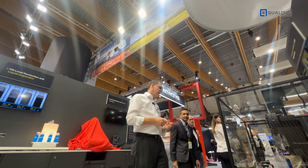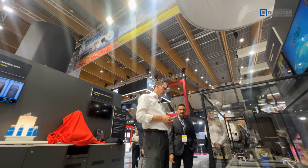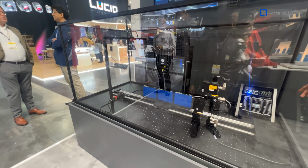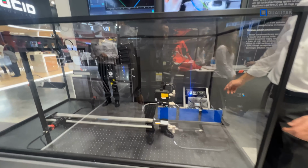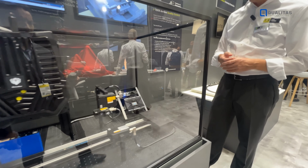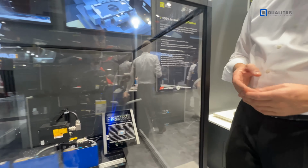Okay, here next we have the LMI trade show demo showing battery inspection. So this is an extremely fast timing sync box for our sensors, and the Master 810 distributes also the encoder signals from the linear axis, and the three sensors are calibrated together to create this image here. So it's a fusion of multiple images. Later we will see it again.